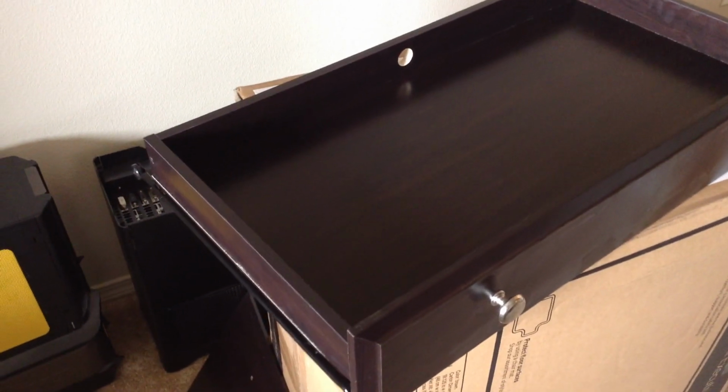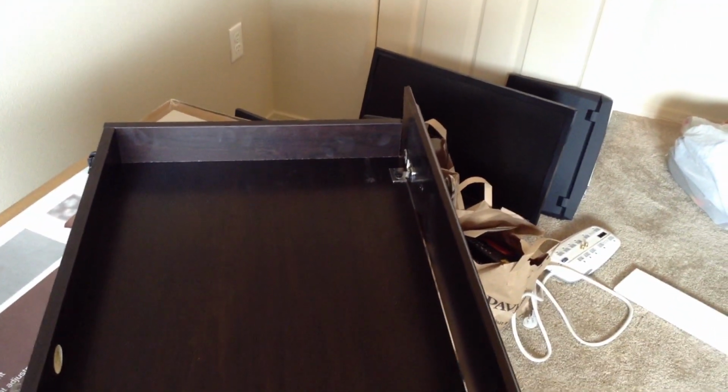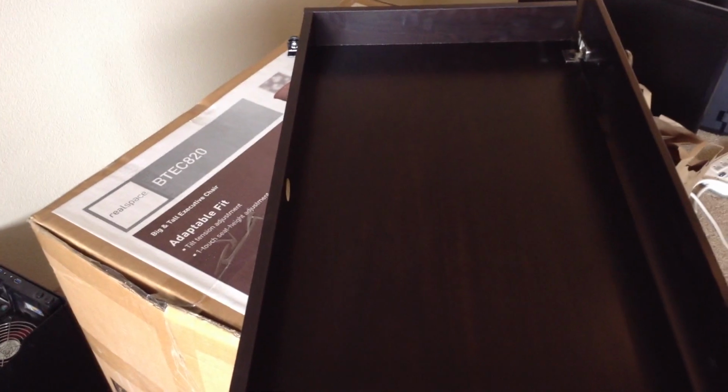The keyboard drawer all done. The perimeter thing, you're using the longer black screws for that, and of course there's a spring-loaded hinge mechanism here, which makes it kind of a little bit of a complex drawer. Probably the most complex of the drawers on this build, as you have to make sure that everything's kind of even when you put that together, and then of course this one will just set in there. The reason you've got a hole here is so you can pass the cords for the keyboard through if it's not a cordless keyboard. Things you're going to see in the instruction book is this cross bracing.